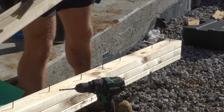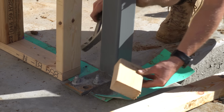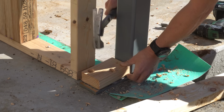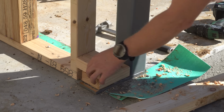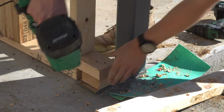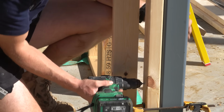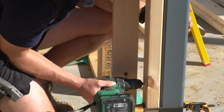So to make this wall work, I'm going to have to go through, take every single stud apart so I can firstly screw that first stud to the steel, and then attach every single stud to it. But it gets even better from there. These 4 studs are actually sitting on top of a steel cleat, and I can't just have this wall hovering because this wall is supporting a bit of weight, so I need to check out the bottom plates, make them sit hard down to the steel cleat, and then individually go through after that and put in every single stud.